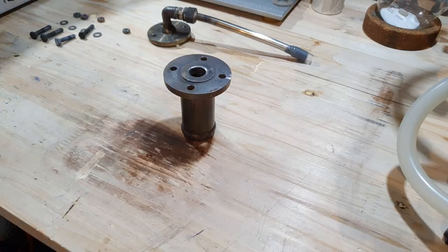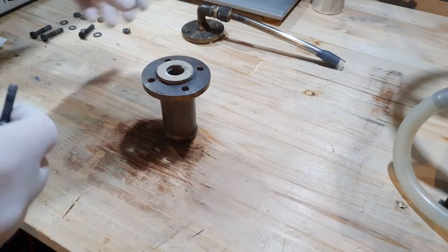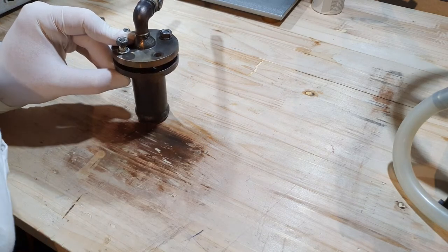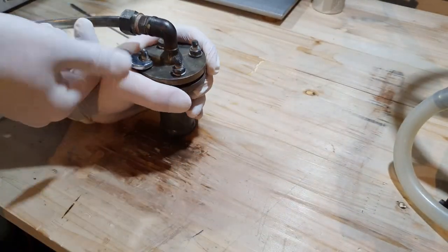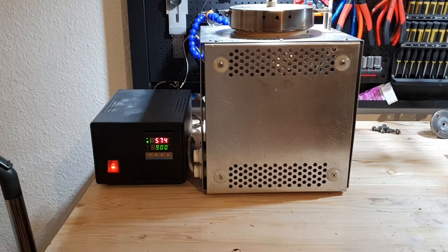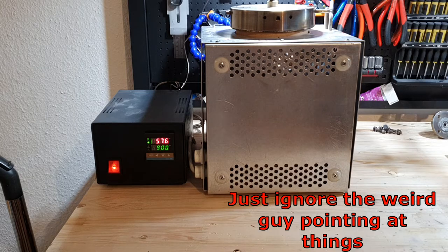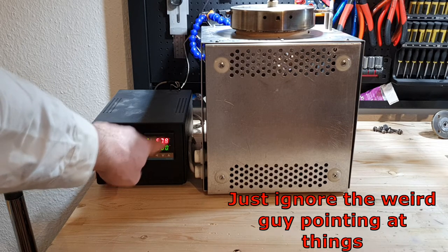Here you can see me adding the lithium and the cesium chloride to the reaction vessel. I filled the reaction vessel with dry argon to displace the oxygen, and I also dried the cesium chloride under vacuum to drive out as much moisture as possible. It is crucial to use anti-seize on the threads of the bolts, otherwise you won't be able to get them off after the reaction is done. The temperature controller for the oven is a PID controller I built, using a thermocouple that reaches into the oven to control the temperature precisely — this ensures it is high enough for the cesium to distill over, but not high enough for the lithium to distill over.